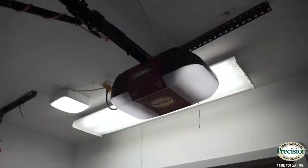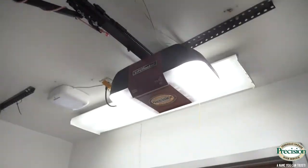Of course, the possibility of your door being damaged or broken is a reason it wouldn't close — but realistically, how did you get it open? Most of the time when the door is broken you can't open it either. When you're having a safety eye issue, when you attempt to close the door the light will flash, and that tells you it's a safety eye issue.